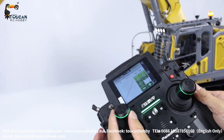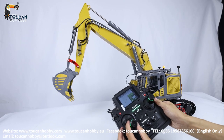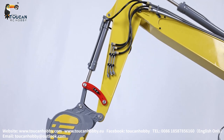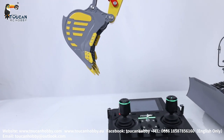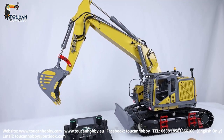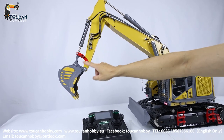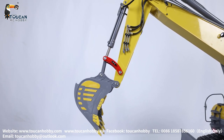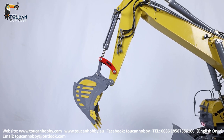That's the front arm, going forward. Front arm slowly and increase, going backward. So this excavator has a 7 channel distribution valve. One for blade, big arm, front arm, bucket. That's 4 channels, and 3 more channels here for spare. One for quick connection, 2 channels for future upgrade for grab or plier. Yeah, that's all, the 5 to 7 channels can be used.